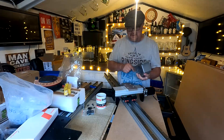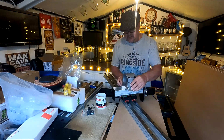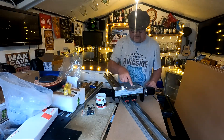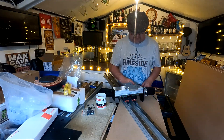I've drilled four clearance holes for 6mm cap-heads. The 6mm cap-heads will then screw onto that plate. So in short, that plate goes onto there at 60mm pitch, and it screws up to any position I want when I build the machine.